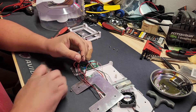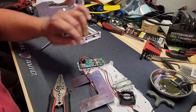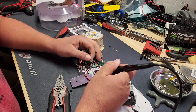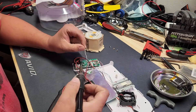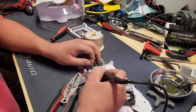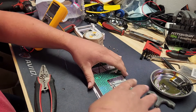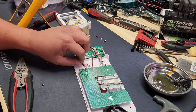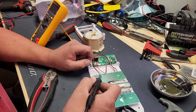I guess all there is to do here — I'm going to actually cut this off because this is all kinds of burnt. Strip this bad boy, solder back right to the board here. Using a little bit of lead solder because... hey, I'm not dead yet. Tinning wire is for people that are afraid. Also, you know what — tinning wire is also for people that want their circuits to stay together and not self-destruct like this one did. Alright, she's in there. I think the easier way to do this is to flip this guy back over, get the line back up here, get that back in there, and he's on with the pegs. We got a cold solder, so hopefully this won't flow out of the joint. We're going to try to solder from the top here and clean this up a bit — maybe make sure this doesn't happen again.